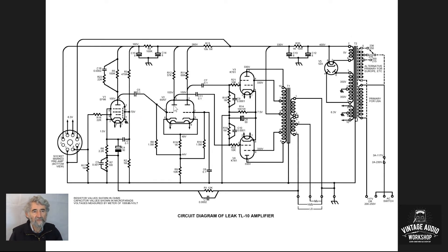The anode feeds the grid on one side of the phase splitter, in which both valves are involved. The bias resistor is a small value; the cathode resistor is a much larger value. Whatever happens on one side — if current increases, the cathode voltage rises — this is equivalent to applying greater negative voltage on the other triode's control grid, which is held AC-steady by decoupling. So there's a constant DC bias. As current rises on one side it falls on the other — a seesaw — and that's the phase-splitting action driving the output valves.